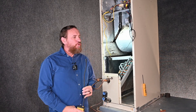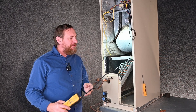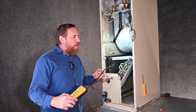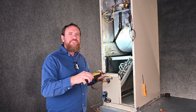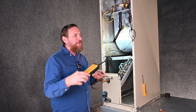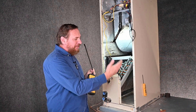If we're going to do our leak check for our evaporator coil, we can take that panel off. Our meters usually have some kind of an adjustable end. This one has different adapters and you can generally check in the vicinity to see if you have any refrigerant pulling up in there, but you are limited on what you can get to. We can see if there's refrigerant in the general vicinity, but trying to pinpoint where that refrigerant leak is inside of this unit is very difficult, especially where we have all these U-bends in the front side. Those same U-bends are in the back side.